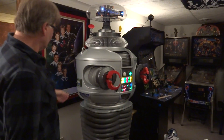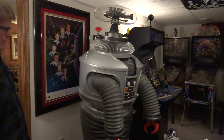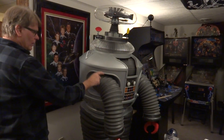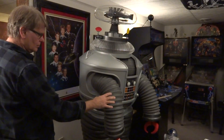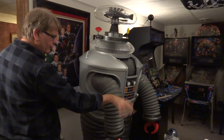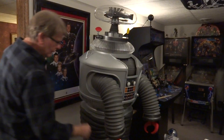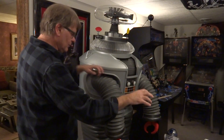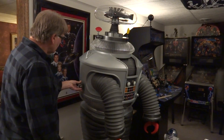I'll do it quicker this time. When the arms get about halfway down, I release the servos in the arms. We have one DC motor running the elbow — you can look at my other YouTube videos for more on that. There's also a wrist servo running up and down, plus a back-and-forth servo and the claws. When they get about three-quarters of the way down, I release all those servos, and that gives it a better appearance of just kind of hanging and drooping low and free.